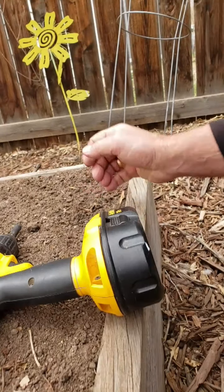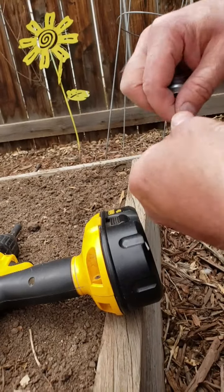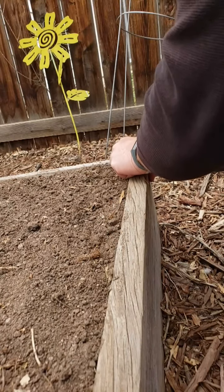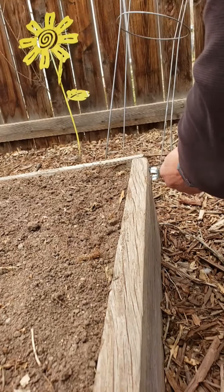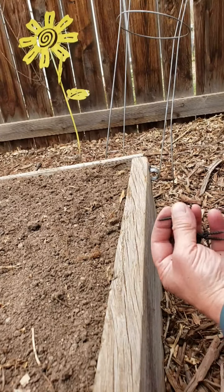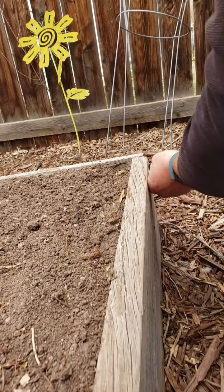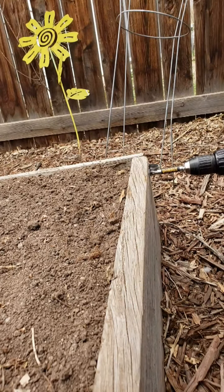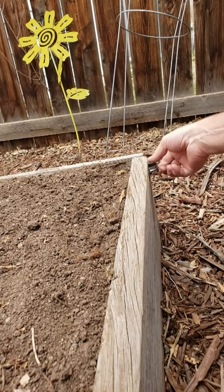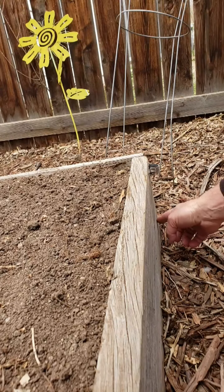Since I've finished marking these every three feet, I'm going to take my straps and my screws. Where my marks are — starting here at the very beginning — I'm putting a strap close to the end but not all the way, so I don't split it out. I'm going to put this one here, keeping them relatively level with each other. I'm not going to screw them in all the way, because when I put that half-inch PVC in there, I want it to be able to slide easily. I'll put a second clamp below afterwards.